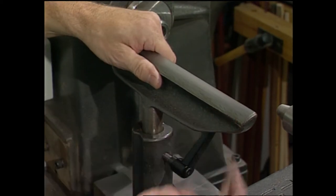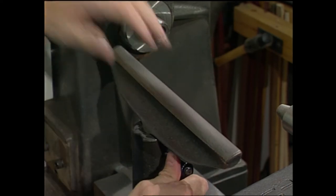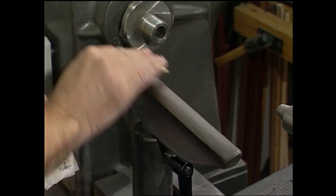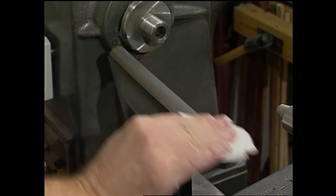And don't forget the tool rest. Spray the post, and now this will move up and down very smoothly. If you have any dings or any grime on your tool rest, take a piece of sandpaper and lightly rub across it — that helps smooth it out. Then top it off with some paste wax to make the surface even smoother.